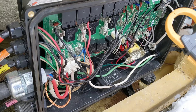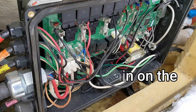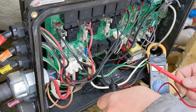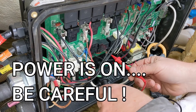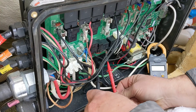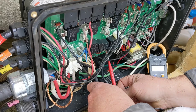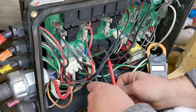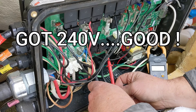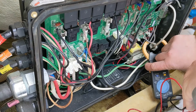I'm going to test voltage — I'll turn the voltage on. You've got to be careful doing this. Put one lead on one side — doesn't really matter, red or black — just be careful not to touch anything else. We got around 240, which is good.